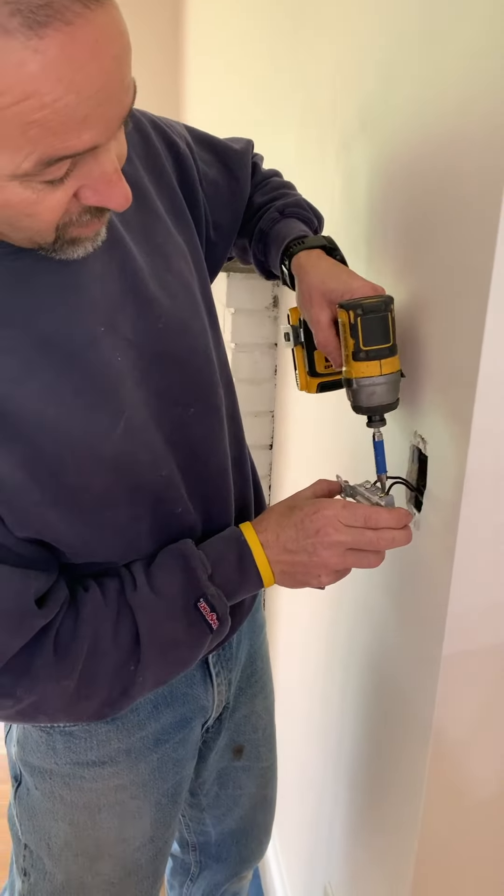As you can see, there's only two wires on the side of that. This one is supposed to have a ground wire attached to the side of it, but it does not. So we're going to need to add that to the actual plug, but that's not going to be part of this video. Today's video is just for replacing a single one-way switch. One-way switch means that it runs one location on and off — you can't go to another location and turn the switch on and off. That's a three-way switch, whole other conversation for a whole other day.